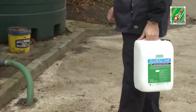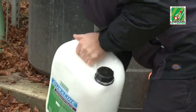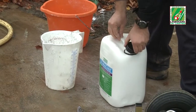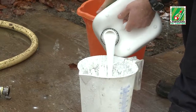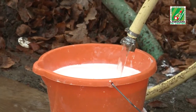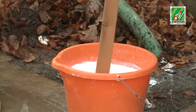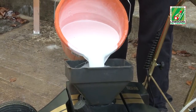As with the Impact paint, the operator shakes a container to distribute any contents that may have settled out in storage. The container is opened and the operator half fills a bucket with clean water. The correct amount of paint is measured out and poured into the bucket. Water is then added. The mixture is stirred and poured into the tank, avoiding any spillage, and the procedure repeated until the tank is full.